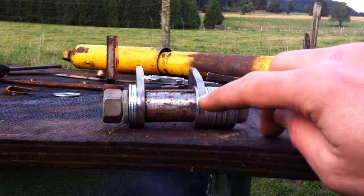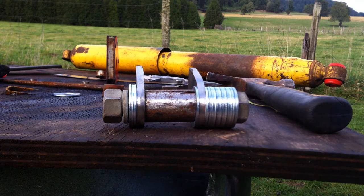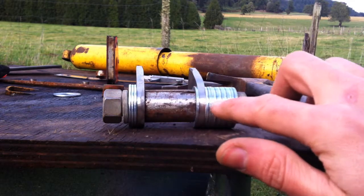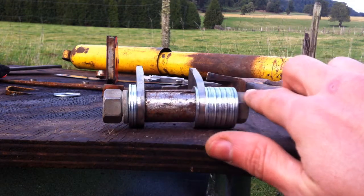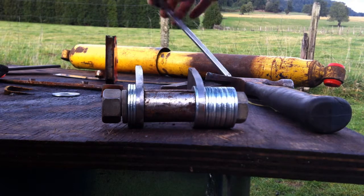Here you see the bung placed, and I went ahead and put an extra washer on the inside there — that allowed me to get a little bit of extra spacing so that the bushing would fit in nice and neat. I had a long bolt so I used those washers on the side to keep from getting slag on the threads of the bolt. You want to be careful not to do what I did there by using the pressure washers and multiple washers because they shift around, so you want to use just one standard washer.